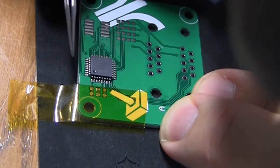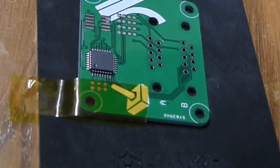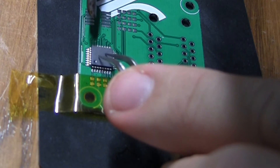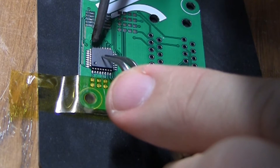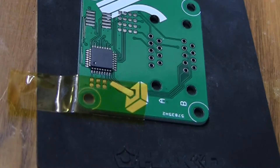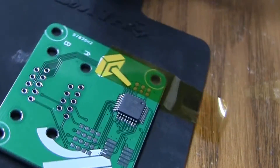As long as it's really close I think you're good — you just want to make sure that you have good contact. Ideally you want them to be perfectly centered, and certainly if you're doing this professionally they have to be, but for hobby stuff you just need good contact between the pads and the pins. Now I need to tack the device down with a little bit of solder directly on the tip of the iron. It's a little harder in this first step because there's no flux on the pins, only on the pads. If you have a gel flux you can squirt on this it becomes a bit easier — I don't, and putting flux on the pins would have moved it out of position.